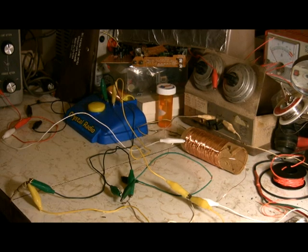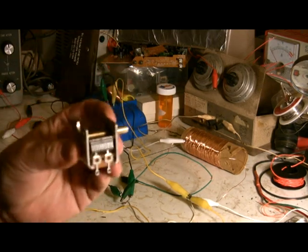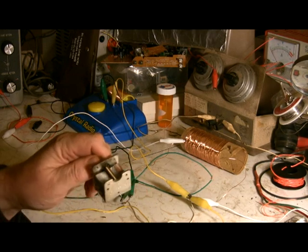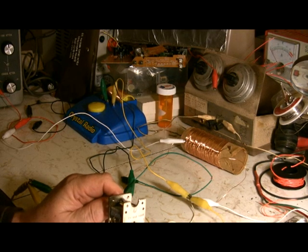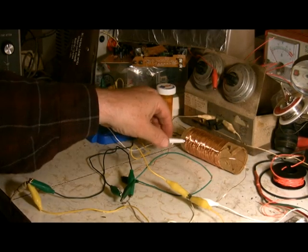Okay, so I just wanted to show you that you actually do not have to have the capacitor, but man, what a difference it makes. That's why I'm saying it's good to get it. Now, as we go on, I have several other capacitors. You might find one of these. This is an open air capacitor, the kind you might find in some old radios. It's got the vanes. That one might be easier to find if you have some old radios around. And I think I'm going to try to dig up a small tuning capacitor, like a trimmer, that you might be able to dig up too.